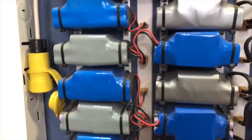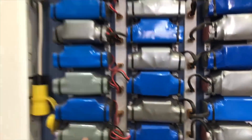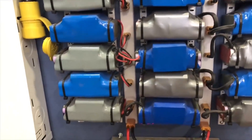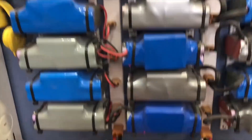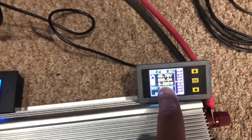This is the battery that's going to power this thing — about 15 of these packs right here. They're hoverboard batteries, what we bought back in the day. It's a 10S pack, so about 36 volts nominal.